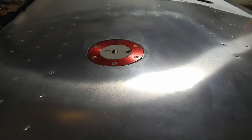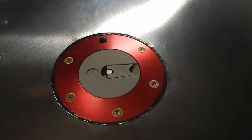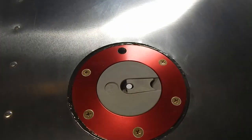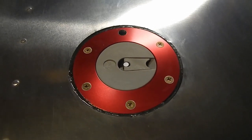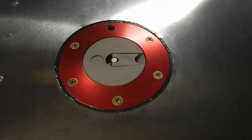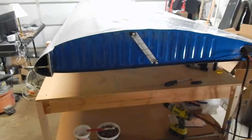The ProSeal seemed to work. I got my fillet around the edge. It's hardened pretty well. This is the next day. We're almost 20 hours, and all I have to do is screw in my fuel vent, making sure that the hole is facing forward. I believe I'll recheck it. And you use some thin or thick washers to make sure the spacing is correct with some sealant, a different type of sealant. But that's it. And then the wing is finished. And then it's a copy and paste for the other wing with the tank. And my wings are done.